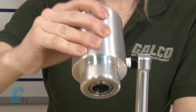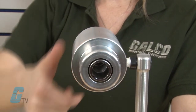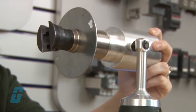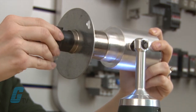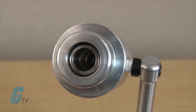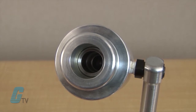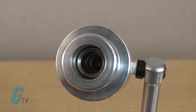The 360 degree rotating head allows for greater versatility in punching at any angle and in tight spaces. It produces 11.2 tons of force and can be used on sheet metals from 10 to 14 gauge such as stainless steel and mild steel. The LS100L is a microprocessor controlled hydraulic punching tool with an automatic shutoff feature that will engage after a completed punch or if overpressure is detected.